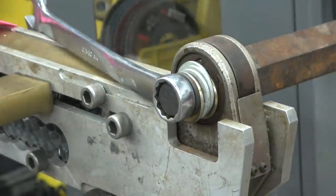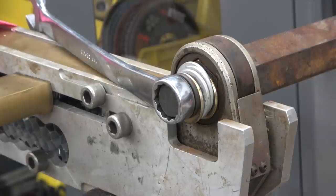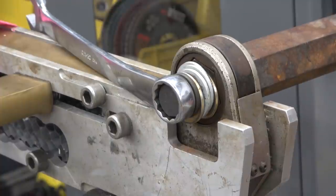It would appear to my trained eye, that's the same, only different. We're yielding that bolt. Look at the pressure come up. We're far past the torque that bolt will yield. It's gone past its maximum strength, and now it's just weakening as the cross-sectional area diminishes. That is, the bolt stretches out. Look at the flex in that wrench. And that's an old school wrench too, not one of these fancy spline drive side hill gouger styles. Yeah, we're just yielding that.